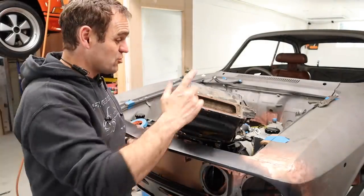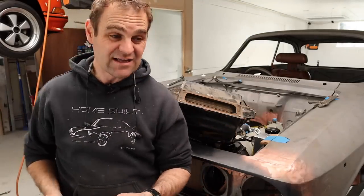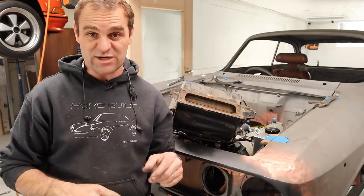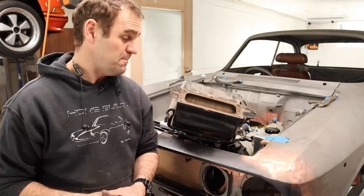But that's also a good point for people who do have old cars. If you have old cars that are overheating on a hot day, that's why it's a good idea to crank the heater in the car. That'll actually give you extra cooling. It might not be comfortable in the car, but you can often watch your temperature gauge fall if you're having heating problems, because that will actually help cool the engine down more.